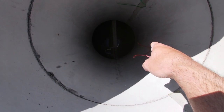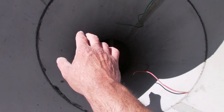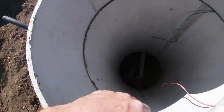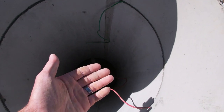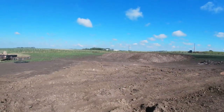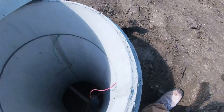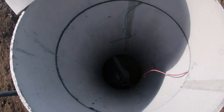So here is the septic tank. This over here is the gray water side, and this is the solid side. So this side is going to be full pretty much all the way to the top all the time. And as you use it, it just kind of spills over. There's a little hole there behind that white thing. I don't know if you can see it, but the water will just spill through that hole into this side. And then there's a float switch on that pump, and once it hits a certain level, that pump will kick in and pump it out over there. When the pump kicks out, whatever water is in that line, it'll just drain back. So that pipe will be empty all the time also. So we should never have any problems with anything freezing.